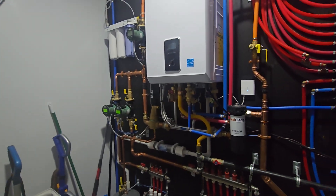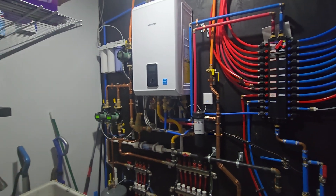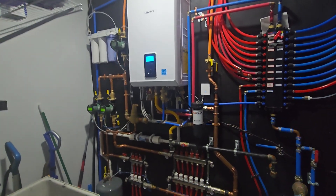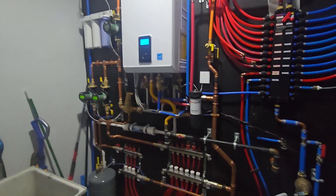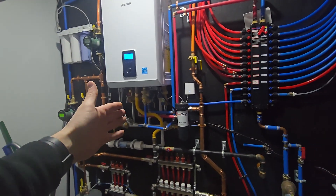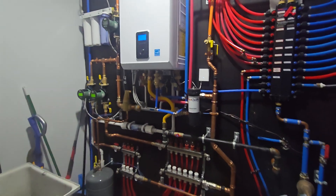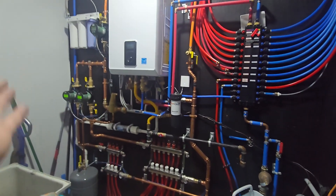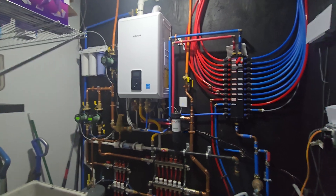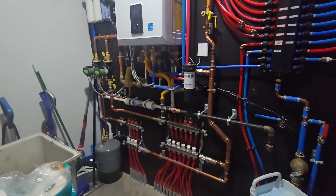A lot of times you'd be surprised — this system can ramp all the way up to 28 or 29 psi. A pressure relief valve is not going to be 100% perfect at exactly 30 psi, so you could push to 30 or 31 before it actually goes off. Don't be surprised if your system is actually running at 28 or 29. What you could do is bleed off a little bit of that pressure. If you're noticing your pressure relief valve is leaking, it may just have one or two or three pounds too much static pressure — maybe you're at 15 psi and it needs that 15 psi of room, so you're just barely pushing above. That could also be because your expansion tank is not doing its job.